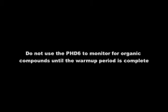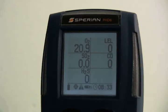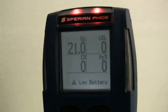The readings shown during the warm-up period should not be considered accurate. At the bottom of the display is a status bar designed to give the user general information about the instrument. At the far right is the time, which can be changed manually through the PHD-6's menu options or set using a PC with Sperian's BioTrack program. A span calibration bottle coupled with a triangular warning symbol blinks to show that the instrument is due for calibration. The pump icon (a spinning fan) will be shown when the pump is detected. The heartbeat symbol is flashed when the PHD-6's calibration status is up to date and the instrument is operating normally. The battery icon at the far left gives an indication of remaining battery strength; when it is empty, it is time to charge or replace the batteries.